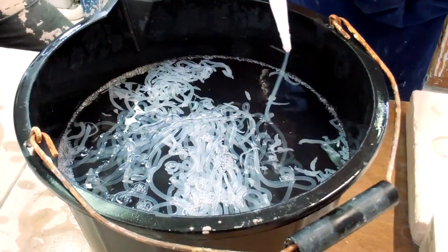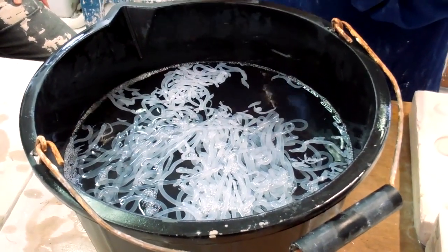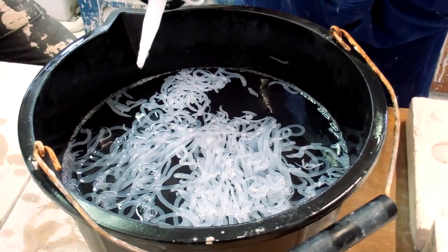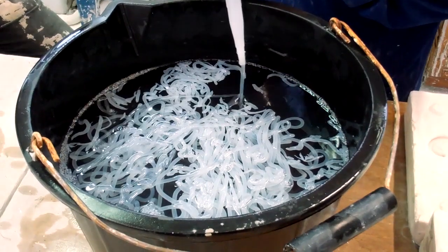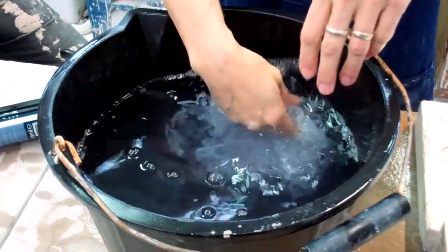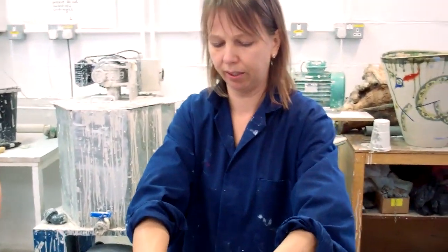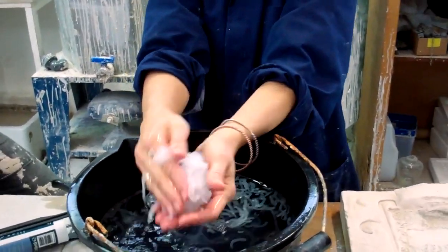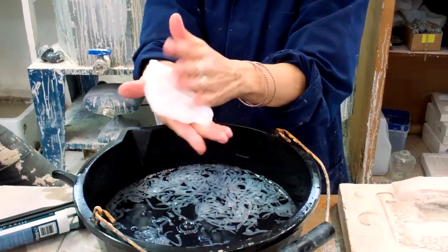If you make a mold of it, you can cast almost anything into it — wax, as long as it's fairly cool and not too hot, resin, plaster, concrete, chocolate, anything really. It would be the equivalent of Gelflex, but you wouldn't have to make a mold first because you can just apply it directly to the outside — you wouldn't have to make a cottle like you do with Gelflex. It's cheaper than Gelflex, although you can only use it once. And if you're making something enormous, you just make a skin of this and back it up with plaster to hold it rigid.